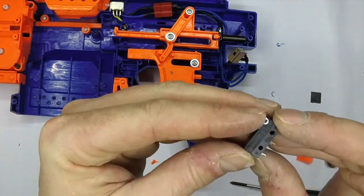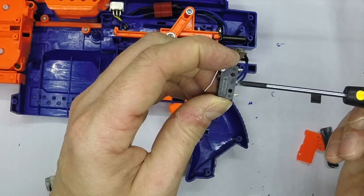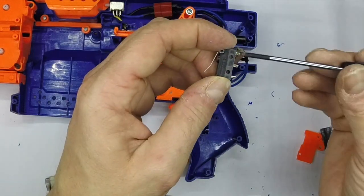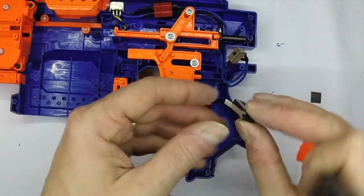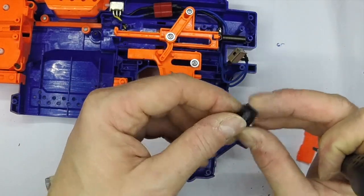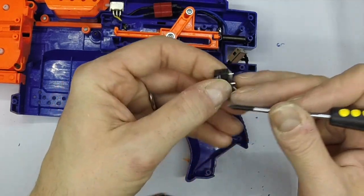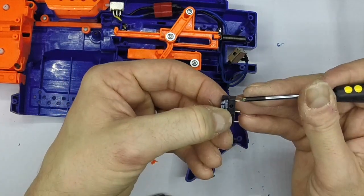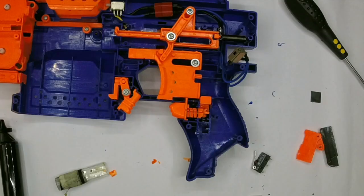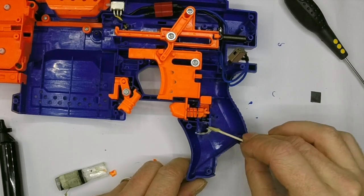The same goes for the back of the micro switch - it may still be covered in stuff from the release agent and the manufacturing process, so just give it a roughening up. The other thing to note is you want to remember which one is your common - you want the common and the normally open. It says so on the switch, but in this instance I'm going to flip it over, so I'll know that the common is the end pin and the normally open is the middle pin. I won't be using the normally closed.